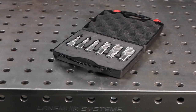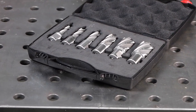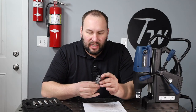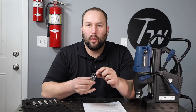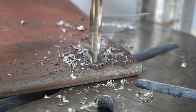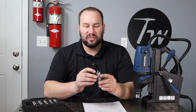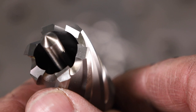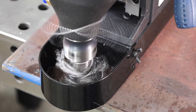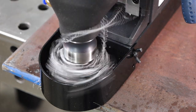If you're not familiar with what an annular cutter is, it's this special type of bit — and this is a set that Evolution Tools provides as well. If you look, it doesn't cut the whole way through. If you're using a standard twist drill bit, you have to remove all of the material out of that hole as chips, where with an annular cutter you're just removing the outer perimeter, almost like a hole saw, but much more rigid, much more accurate, and able to produce a high quality hole in a hurry.